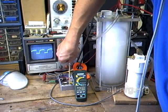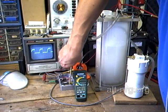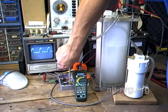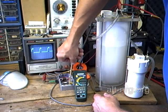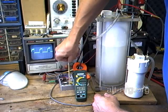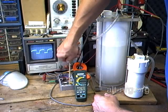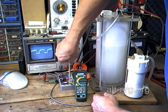What will happen is the peak current will go up but the duration of that peak current will shorten, and the RMS current should remain fairly constant. Over time this peak will become shorter — that's what it will look like as the cell heats up. At that shortened duration I'm drawing 2.6 amps. I'll bring it back up to 5 amps and it flattens out right there because I can't go any higher than 5 amps — that's my maximum current.